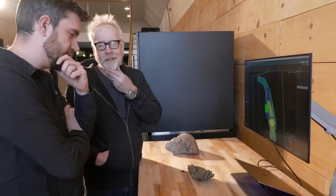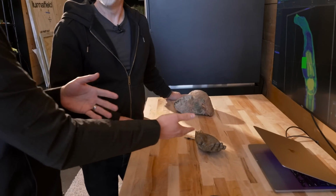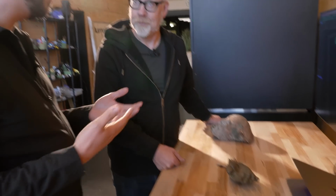You know, I was reading about crash test dummies, and it turns out that they've been making these the same way, at least this model, since the 70s. Yeah. And all of the different specs and details and actual construction methods are specified because they have to be the same across different crash test dummies made for different manufacturers and different applications. Right. And so they actually pour materials that were common in the 70s that are no longer common today. They use the same manufacturing methods. So today we might see an overmolding operation would be more common. It's simpler. But in the 70s, that maybe wasn't as common for those materials, or even possible with those materials.